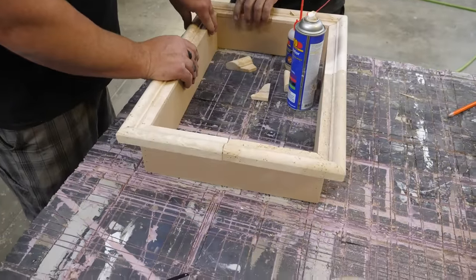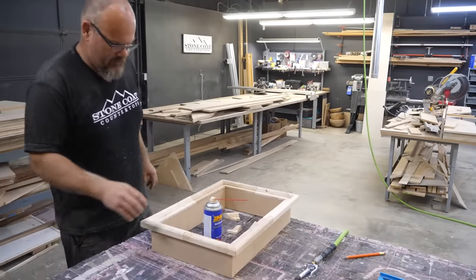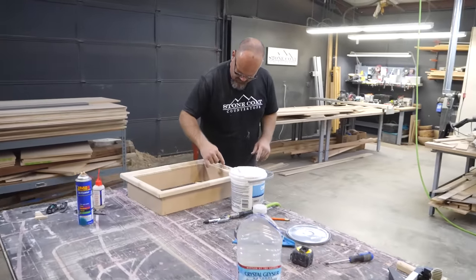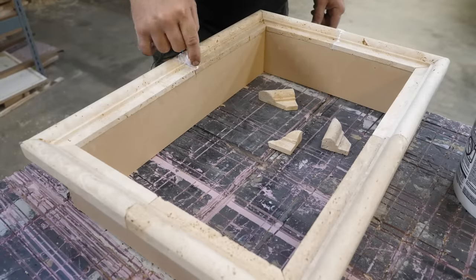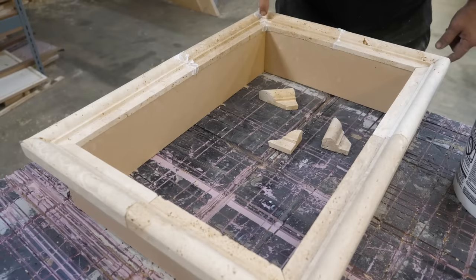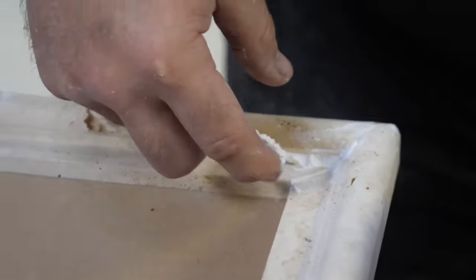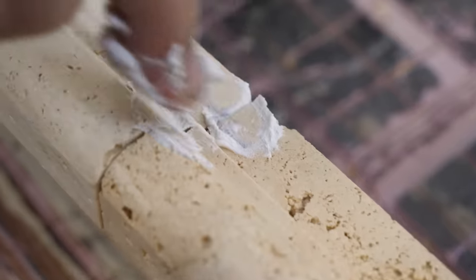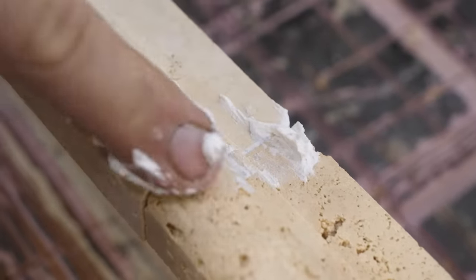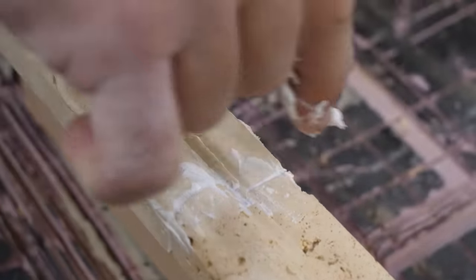Oh yeah, money. All right, I'm gonna just grout this with Omni Grip. I'm just gonna use this to fill in these joints. Kind of make my joints look perfect. They're pretty dang close. This is just a pre-mixed mastic. Dries really fast. I think I'm just gonna grout the whole thing and then wipe it clean.